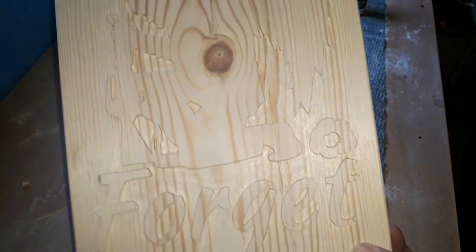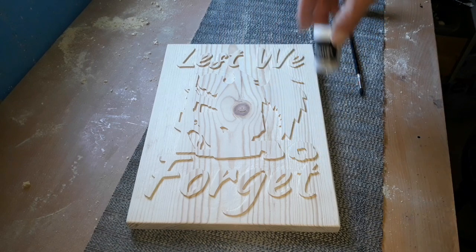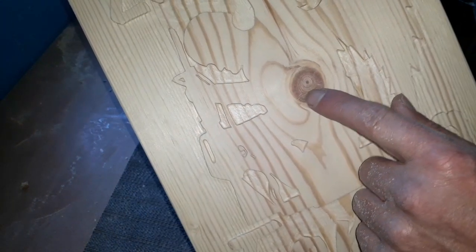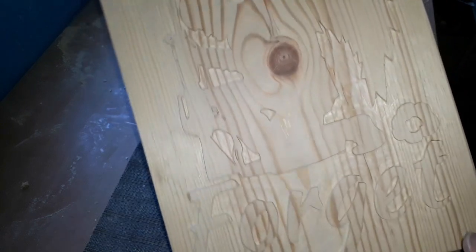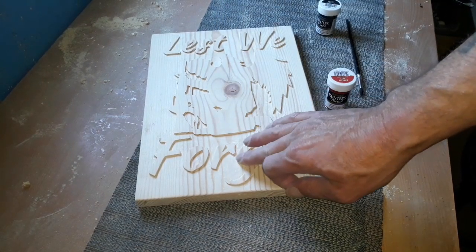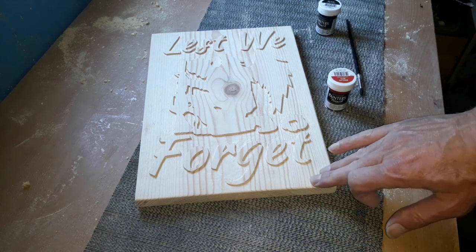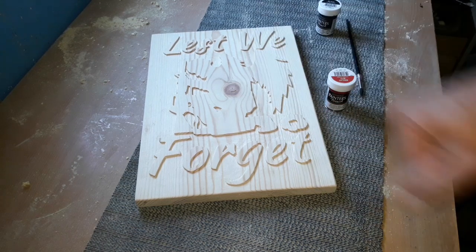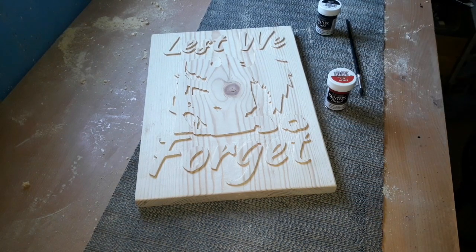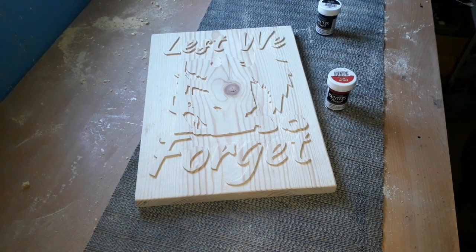That's all nicely cleaned down now. As the client requested, just a standard painter's black for all the lettering and the soldier. There is a knot in the middle here, but that doesn't matter as it's all going to get painted over. There's also a little filling there — you could fill it with some sawdust — but I think the paint's going to cover that nicely. Then we've got the red for the poppy itself. It's going to be a little delicate process painting this because we only want to paint the top of the wood, nothing down the sides and nothing on the back. Once it's all painted, we'll put on linseed oil to darken the wood back down — I like to linseed over the top of the paint — then once that's dry we'll go over with a small varnish spray to finish it off.